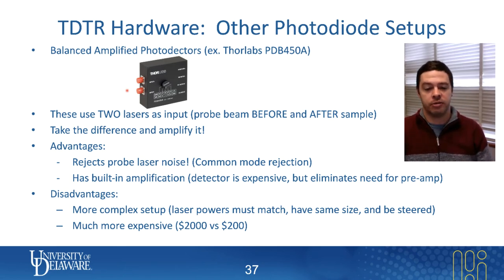These tend to be low-noise amplifiers that are pretty close to the quantum limit. So you get a built-in amplifier, and this essentially eliminates the need or desire for a separate preamplifier.